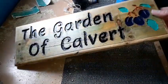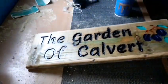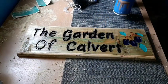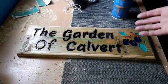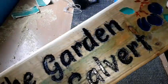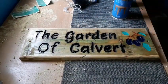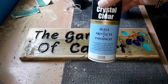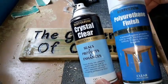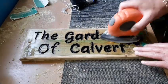You can see from that all the painting's done. We've got some kind of plum effect going on there. The only mistake I did make - and it's a lesson learnt - was to spray this polyurethane finish as a sealant to stop the bleed. It sealed it just a little bit too well, and the paint wouldn't stick on at all. So I've had to go over this about six times and it's left that glossy shine on it. So I'll know for next time - it'll be ideal to finish with, but not for sealing with in my eyes. I found my empty container - this is the one I would normally use, and that's spot on. This one, not so clever. Anyway, let's sand this down now and see what we've ended up with.